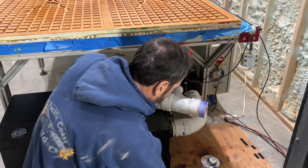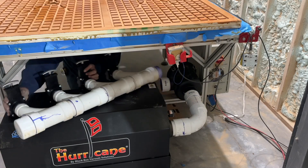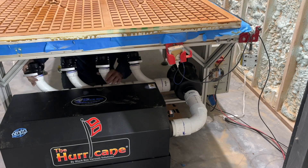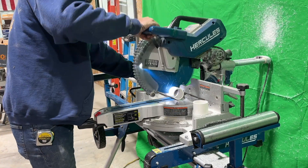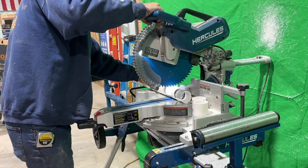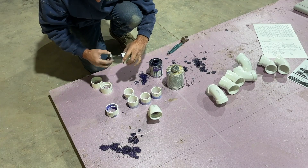The valves and everything had to be behind the vacuum pump, which in retrospect is really the best place because you want to be able to pull the vacuum pump out without damaging all your piping. All the fittings are behind the vacuum pump — you've got to reach under there to pull the valves, but it's not that bad. Now all these pieces are going to go up through the bottom of the vacuum table.